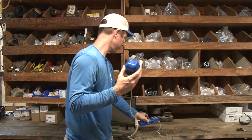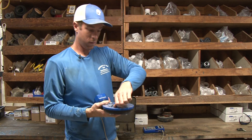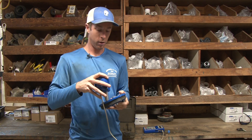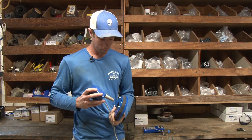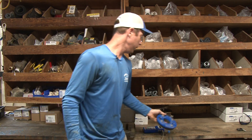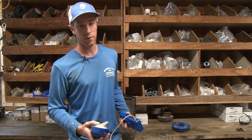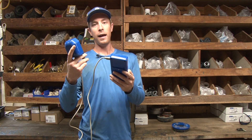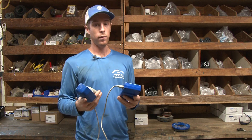What's nice about it is this actually slides down in the port of a well seal. I'm going to go out on the job for a follow-up. This is supposed to stick down through the access port in your well seal and monitor the water level. We've done some bigger pump tests on some jobs and compared this to the high dollar water level monitoring devices, and this device has been within about half a foot of the two, three thousand dollar water level monitoring devices.